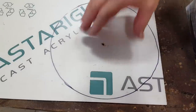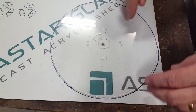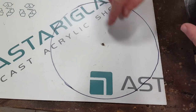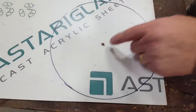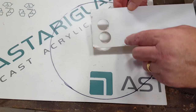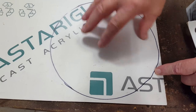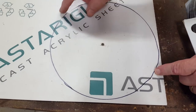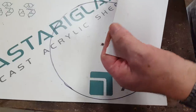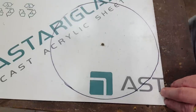I'm out in the workshop. I've got a piece of acrylic sheet here — it's about one millimeter thick. I've traced a circle around it a bit bigger than what this is to get the bigger diameter. I've drilled a quarter inch hole in the center. In the end I'll have to open up this quarter inch hole to about an inch. I've practiced on a bit of scrap and it cuts pretty well. I thought I'd mount it on the router on the quarter inch hole, rotate it, and clean it up that way. It routes pretty well — it didn't crack or anything so that should work. I'll cut this out and set it up in the router.